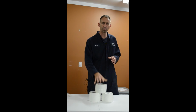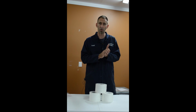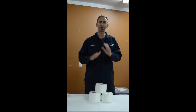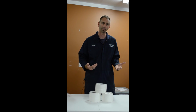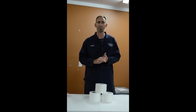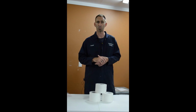So when you use the black foundation tape and get adhesion to the wall, I would say go ahead and tape the wall piece and the floor piece before you put in the foundation pins. Now, this is all considering, of course, that you don't have damp block. If the block is damp or wet, the foundation tape is not going to stick to it very well. But if it's nice and dry and clean, it'll hold that barrier up for a few hours to a few days, depending on the conditions that you're working in.